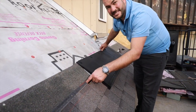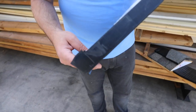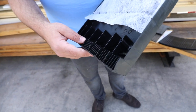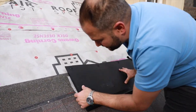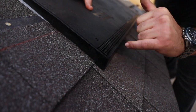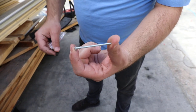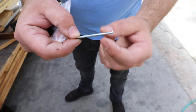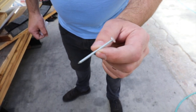You want to come six inches past this slit hole. This lip is meant to catch the bottom of the shingle — you can see there's a notch right here, and this groove is going to sit underneath our bottom shingle. So we come six inches and that's exactly where this vent should be placed. Owens Corning provides two-inch ring shank nails — these are the nails that must be used for this vent. They've thought this out: the length, the width, and the fact that it's a ring shank galvanized nail is what's important. So make sure you use the nails provided with the vents.